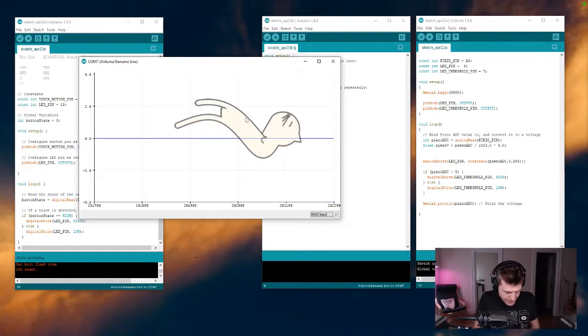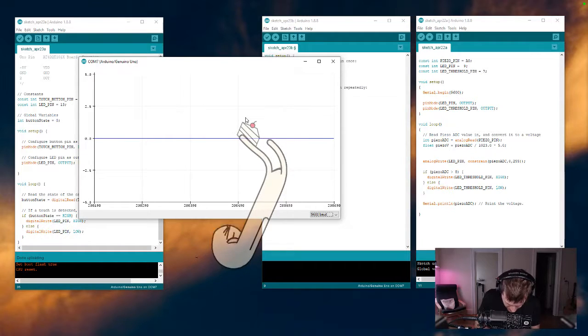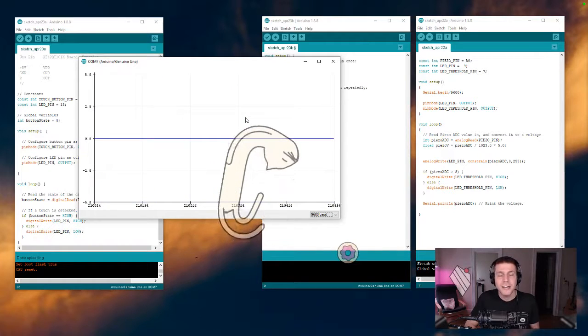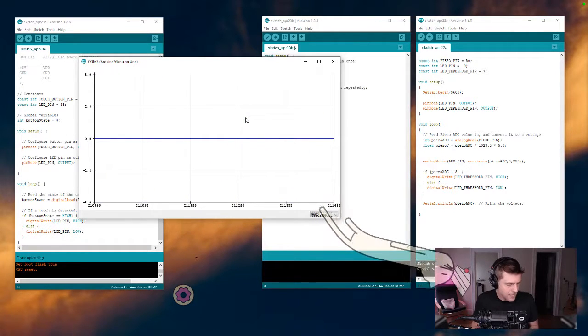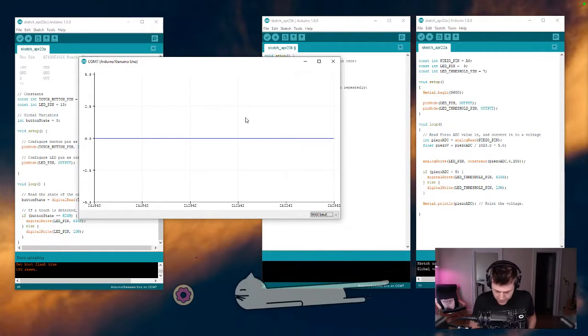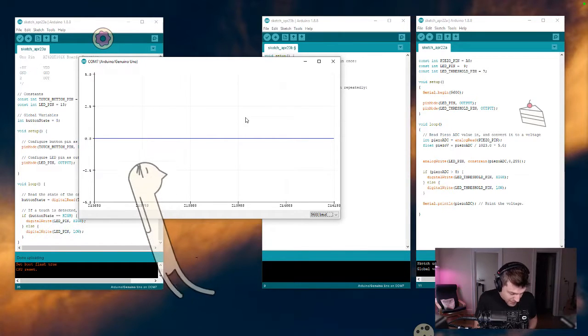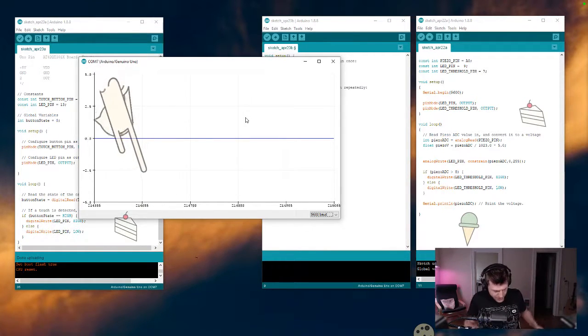Okay, so I think I already have a cable soldered on this for some other project. So I think if we just strip it and stick it on some aluminum foil, then we will have a fancy capacitive sensor. But the bigger the electrode, I think the more sensitive it is to electromagnetic field disturbances. So in some cases, you can not even touch it. Right now, this is too big.